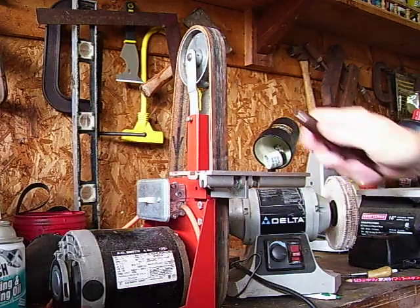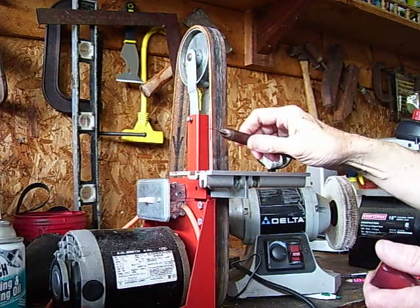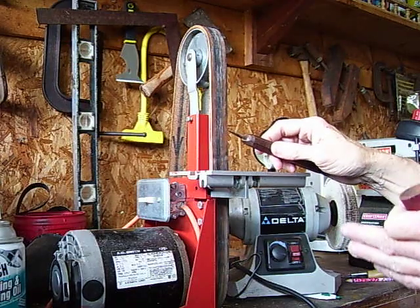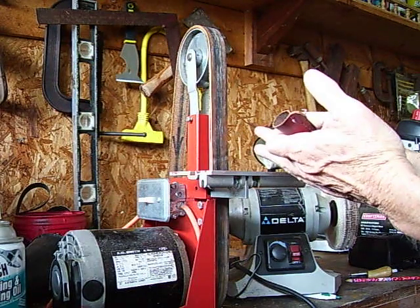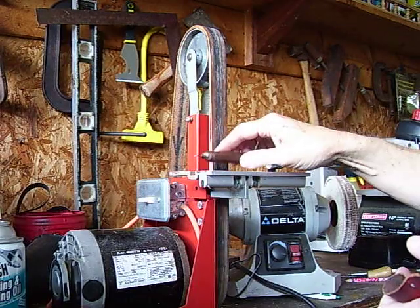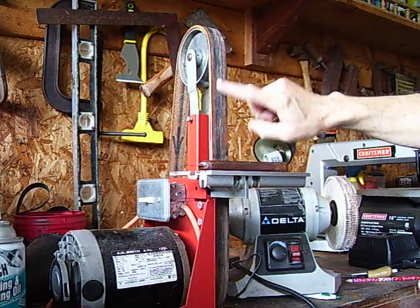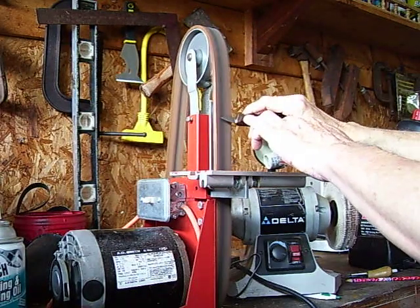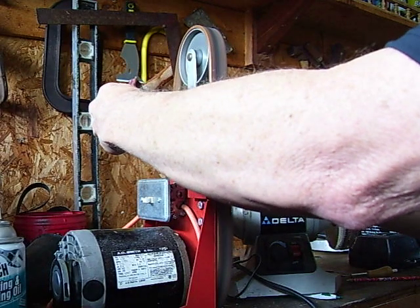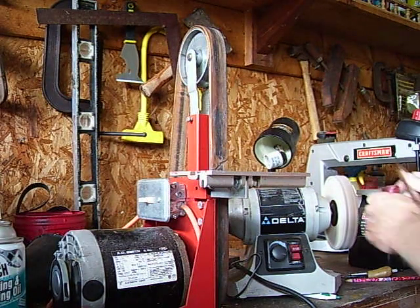When I bought this Ron Wells knife, I have never had to actually take it and sharpen it — I've stropped it the whole time. And the knife gets very, very sharp. But the Ron Wells knife is a very thin knife, so you want to be very careful not to sharpen it too much, because every time you sharpen something, you're taking a little bit of metal off. But if you can get it sharp and just strop it about every 15–20 minutes when you carve, it'll stay just as sharp as can be. Every once in a while I'll put a little oil on here — three-in-one oil, whatever — to keep it limber. You just turn that thing on and lightly touch it.